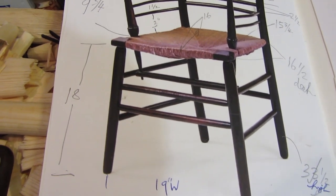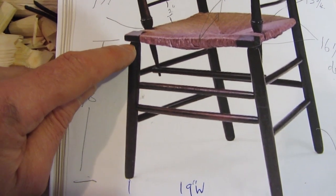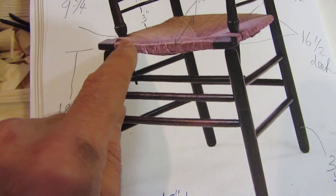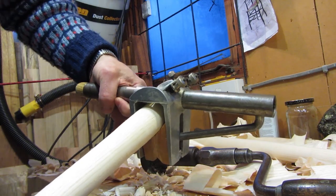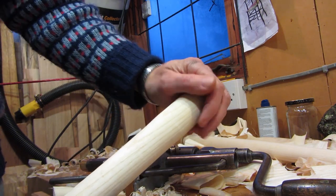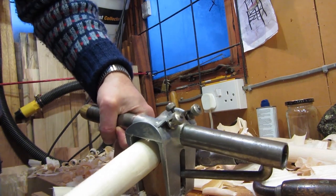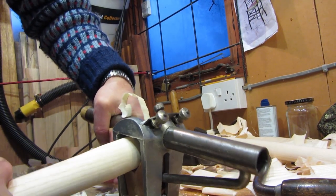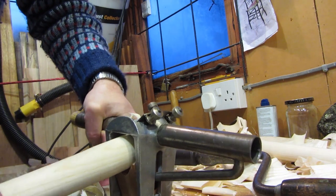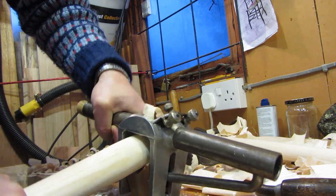My little photo drawing sketches here show the front chair legs. You can see that the front legs are jointed with little spigots onto little wooden blocks, which the cross stretchers for the seat then joint into the sides of. What I'm going to do here is make the top spigots — a little wooden spigot to go on the top of the front leg, so it goes into the blocks of wood between the seat stretchers. To do this I'm going to first put a bevel on the top, so I can get one of my rather primitive auger tools over the spigot and start cutting a square-shouldered spigot.